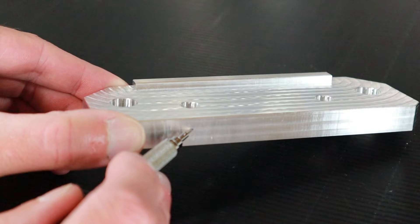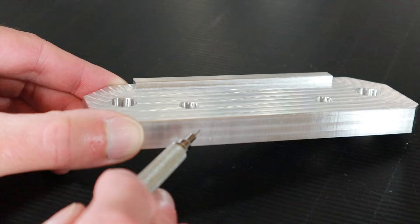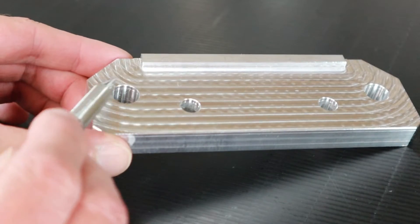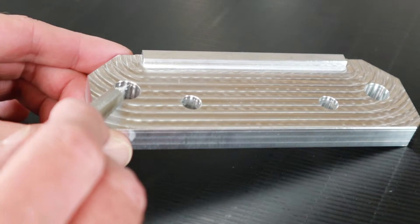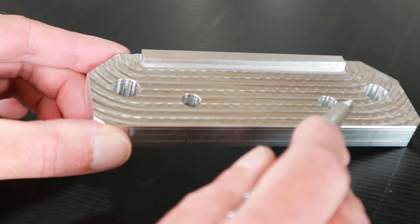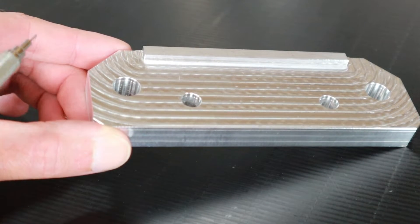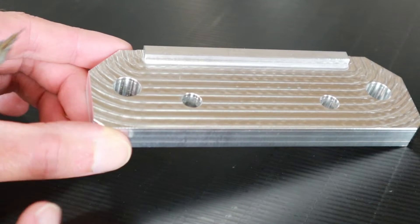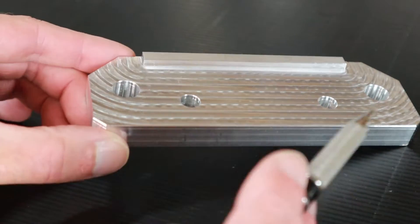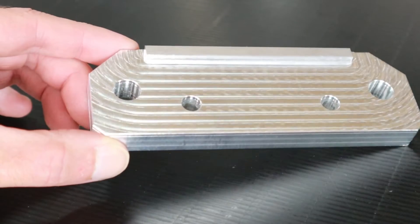There's one, two, three — maybe even the pen starts to stick on it. You can see the same thing inside the hole. The overall finish in the hole is fantastic, but there's a line right inside that hole, and the other two as well. I'm not mad about that. I don't know what it does dimensionally, but it's easy enough to clean up if it would make a difference — we'll know when we put the shoulder bolt in. Overall, the part came out great, and the thickness is right spot on as well.